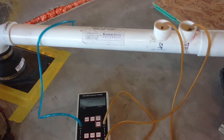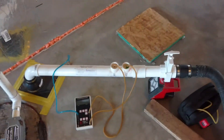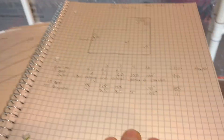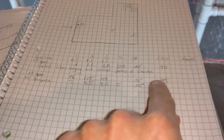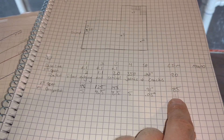With this pitot tube, we can calculate how much air we're moving. We're moving about 11 CFM — that's what our radon system has to be capable of. And you can see before, when I had that pitot tube wide open before we sealed, we were moving 90 CFM. So we only need 11.